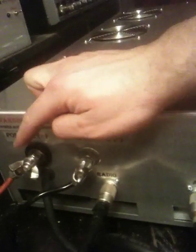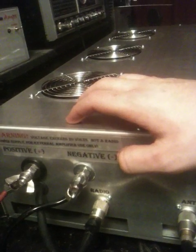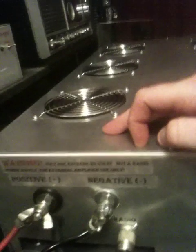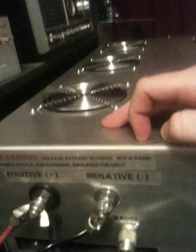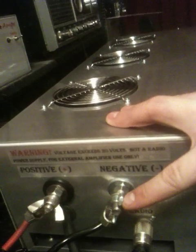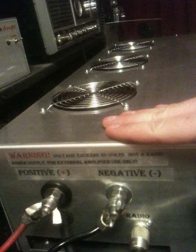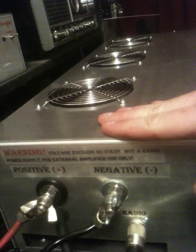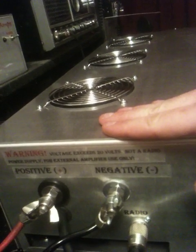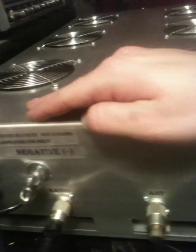You see these ports right here — that right there is the external use of the internal power supply. You have the positive and negative here, and for his request I put a little warning label on there basically saying do not hook your radio up to that. Now these will exceed about 20 volts on the floating side, so when current is drawn and you have this thing keyed up and transmitting, the voltage will drop from about 21-22 volts down to maybe around 16 or so.